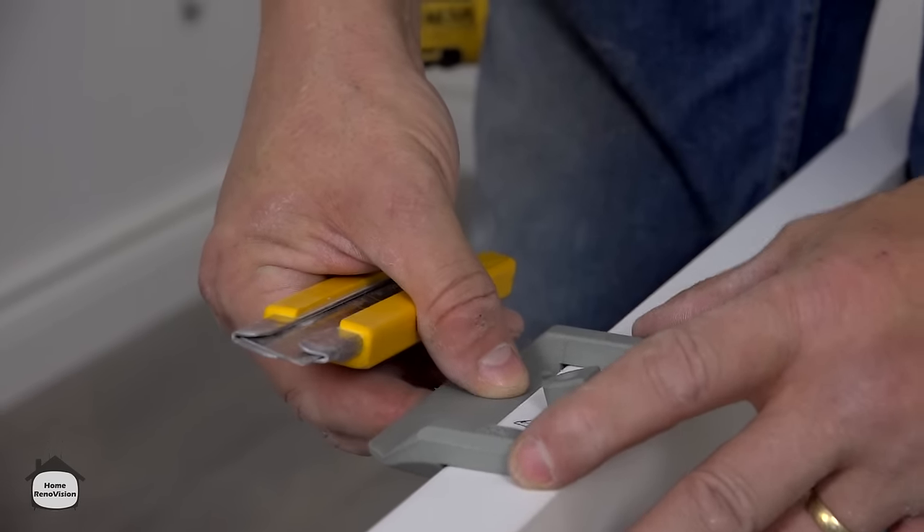With that little template from the kit, they've got you trying to cut a three-and-a-half-inch hinge, but we're using three-inch hinges — and the door jambs come with a three-inch mortise. So if you just trace the hinge directly, you're going to be more successful than using that little kit.